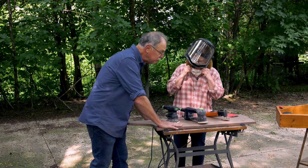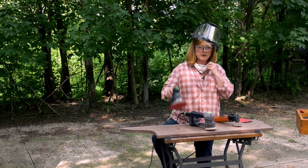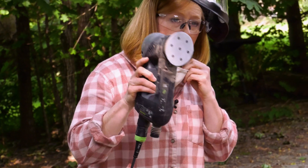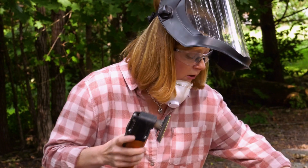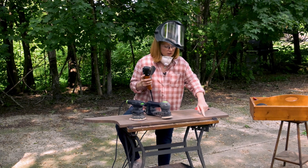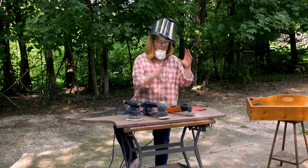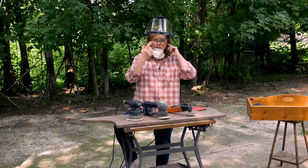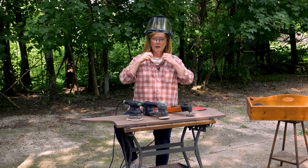Now Susie, I have both sides planed for you. Sanding workshop — take it away. I've got three sanders here: a five-inch random orbital sander, a smaller one, and a detailing sander that I like to use along the edges and to knock off the edges on the sides. Make sure you have all your safety gear — hearing protection, dust mask, safety glasses, and a shield.